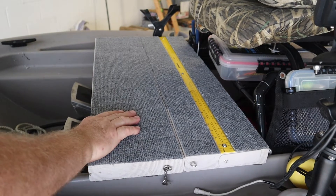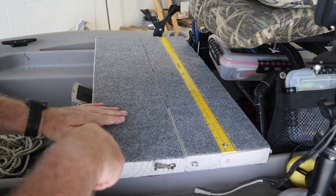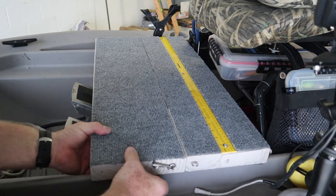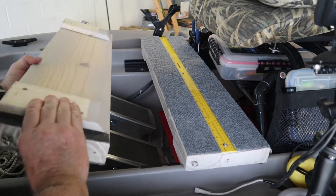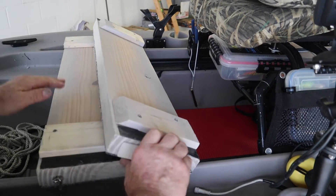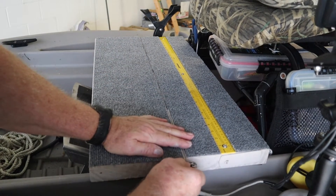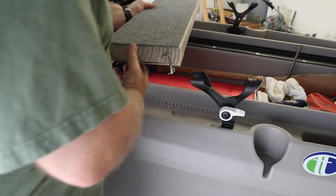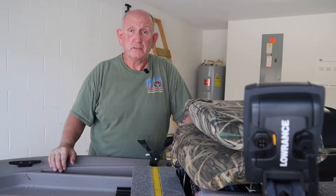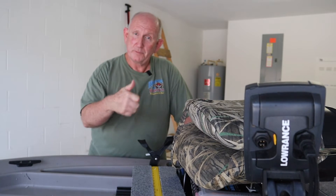Now we have both pieces in the boat. I set these in place before putting the cleats on, made sure they were evenly spaced left and right, took one of those pieces, pushed it underneath until it was tight, then flipped it over and screwed in the two screws. I did the same on both sides. Now they sit right in place. If I want them locked together I lock them here, and if I want them in the back, they both go back there — so the person in the back now has a workbench to work from. If you liked the video, push that button, subscribe, ring that bell, give me a thumbs up, or leave some comments below.